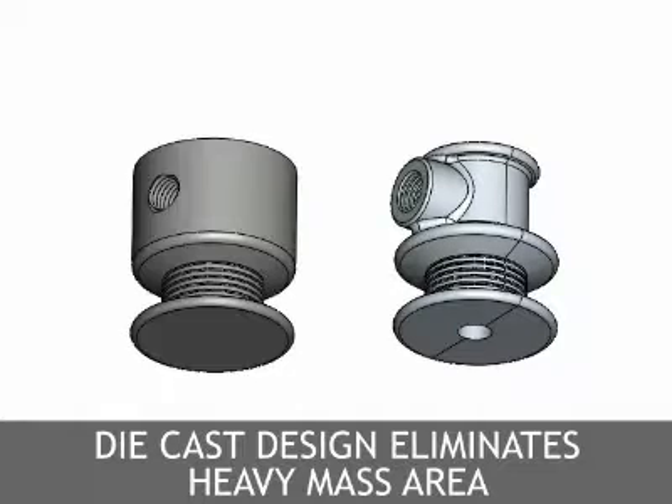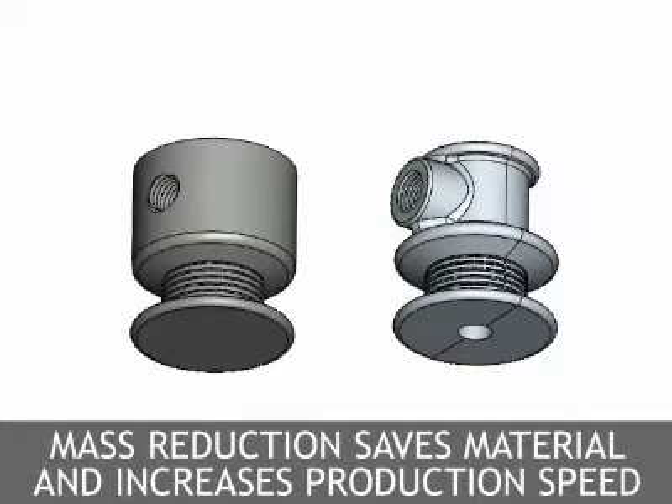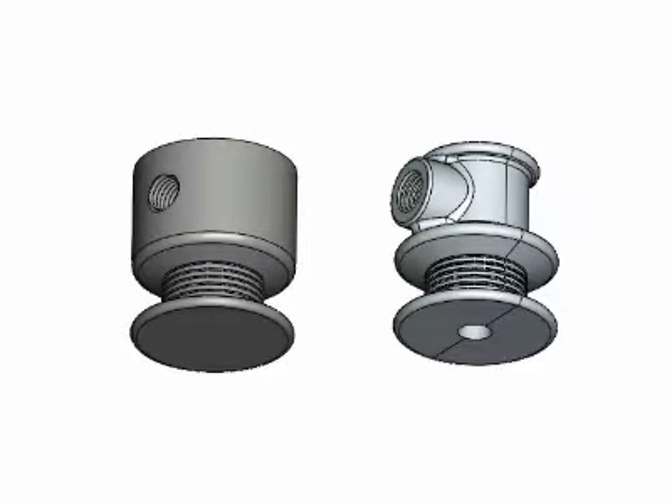Increasing production speed. In this application, even with the reduced material, the pulley is more than strong enough to meet the design performance requirements. It should also be noted that the shaft hole goes all the way through the pulley, further reducing material usage. The material properties of steel bar stock are generally higher than the die casting alloys available. However, in this application, even with material volume reductions, the die casting alloy material properties meet and exceed the requirements of the design. For components that do require higher strength, it is recommended to add ribs, gussets, and other strengthening design features before increasing wall thicknesses. While adding ribs and other strengthening features to a design, it is often discovered that die casting alloys can meet performance specifications previously thought to be available only with high strength materials.